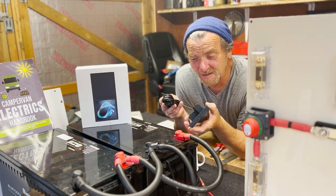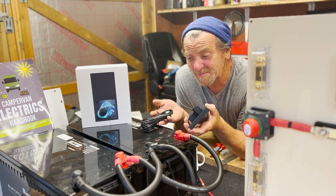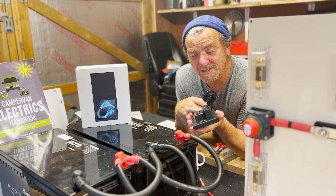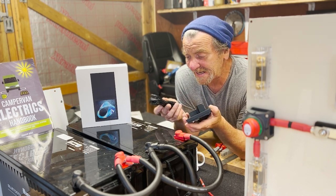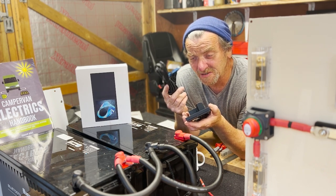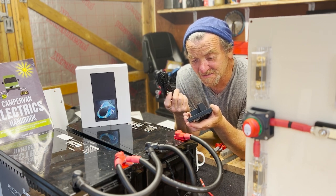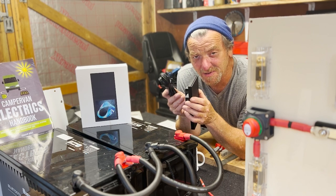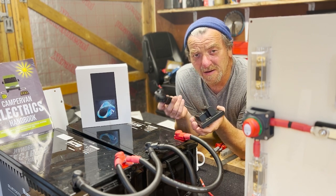The instructions don't say you have to use a fuse and don't mention fuses, but I've got 400 amp-hours of energy here. You may get an electronic fault, a short, or spill water on it, and you can potentially generate a scenario where 400 amps tries to go down this wire. It won't — it'll melt the wire for sure — but that energy burst will definitely destroy the unit. So I'm going to put a fuse in it.